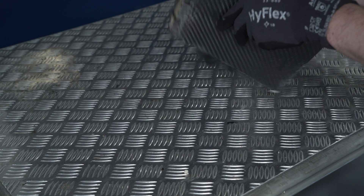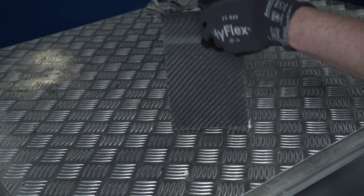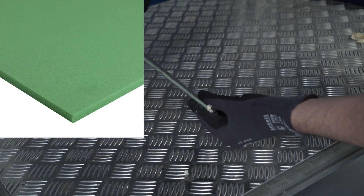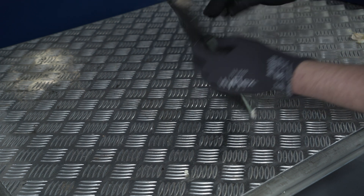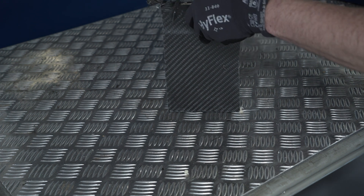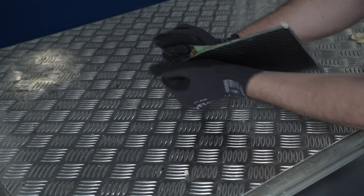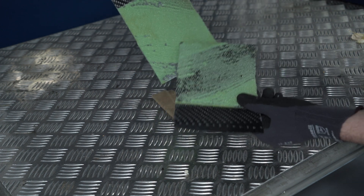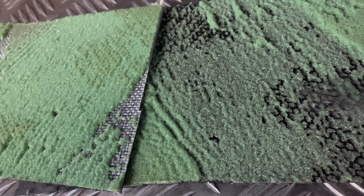Now to how different cores behave. It's common to use a core material to increase thickness and therefore stiffness, but without extra weight or cost. I've used carbon as the bread of the sandwich and the filling is a very popular solid sheet of closed-cell PVC foam. It comes in various thicknesses, doesn't soak up resin, and can be lightly heat distorted to shape a curve into it. My intention is to see if it's good enough for the epoxy to bond to without surface preparation. It fails — but it fails at the centre of the foam, with foam strongly bonded to both sides of the carbon. An excellent companion for the epoxy resin.